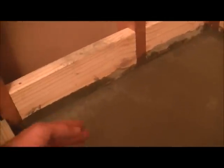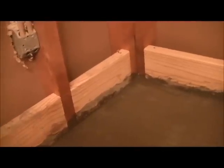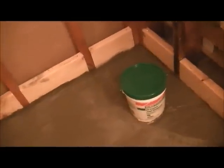These other pieces of wood are two-by-sixes. By default I always use two-by-sixes between the studs all the way around the shower. The reason I do that is because the shower pan liner that I'm going to put in will wrap around the curb and encompass the whole shower floor area, coming up about six to eight inches above. It's not always necessary — a lot of times when I take out shower pans I don't see the two-by-sixes at all — but I just like to have something solid for my pan to rest up against.